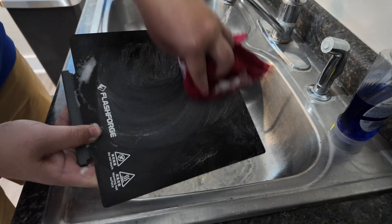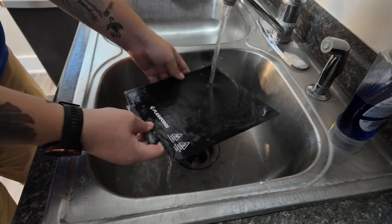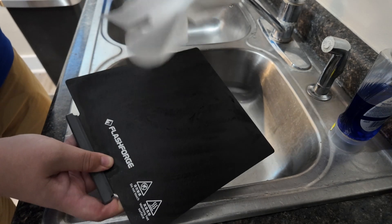It's also going to go a very long way for pulling grease, oils, and other dirt off the build plate. Plus, if Dawn's good enough to use for little ducks, it's good enough to clean build plates, right? You don't necessarily need to use Dawn Power Wash specifically — anything that is a good degreasing dish soap is a fantastic place to start because it's going to lift the oils and greases off of the build plate. I like to use as hot a water as I can stand, as that seems to help loosen things up. So you're going to scrub your build plate with hot water and dish soap really thoroughly. Then I just take a paper towel and wipe it dry. After that, as kind of a baseline, I'm always going to come back and hit it with 91% or 99% isopropyl alcohol.